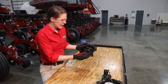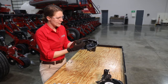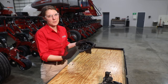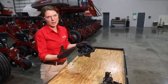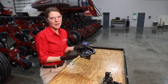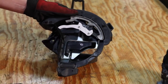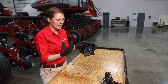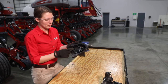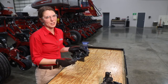Next we're going to look at our brushes. Basically the job of these brushes is to hold seed in the seed pool and keep it out of that gravity drop seed tube area or the speed tube area. What we're looking for here is: are our bristles matted up with seed treatment? Are they free moving? If they are frayed so much that they're catching seed in them, that's a good time to replace them. Or if they're matted up to the point that they can't properly brush anything away, that's a good time to replace those brushes.